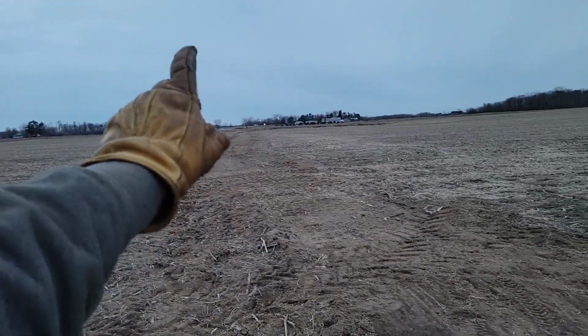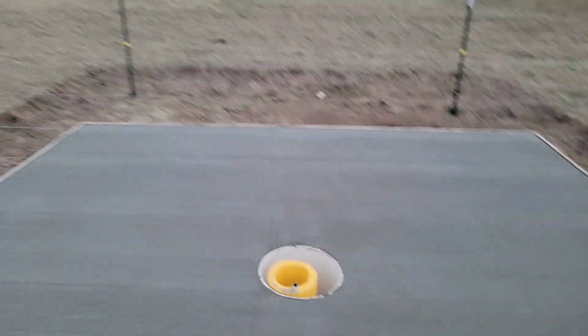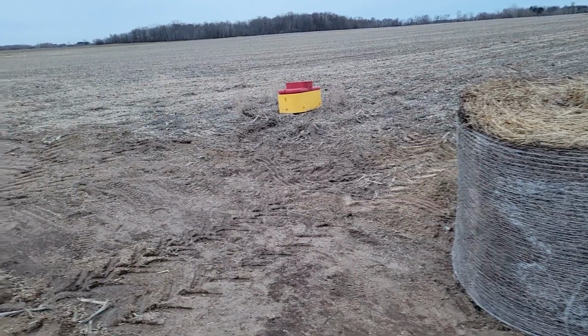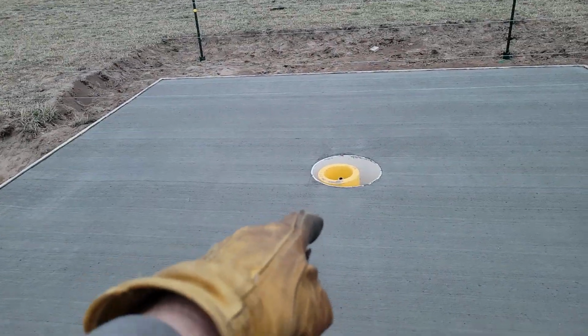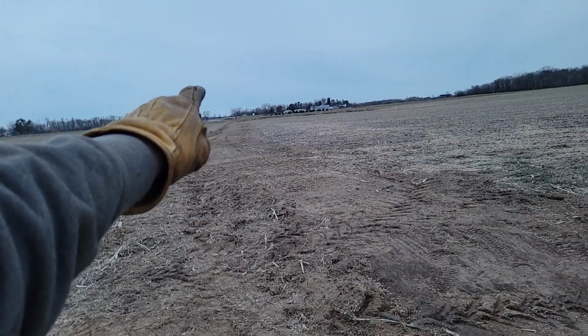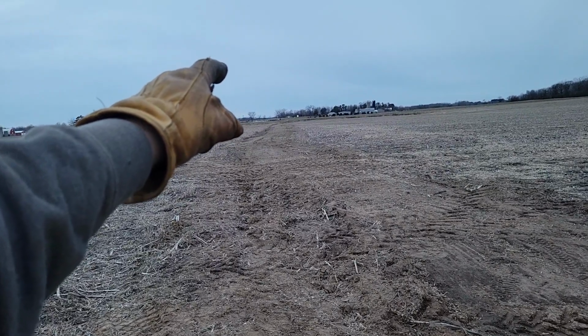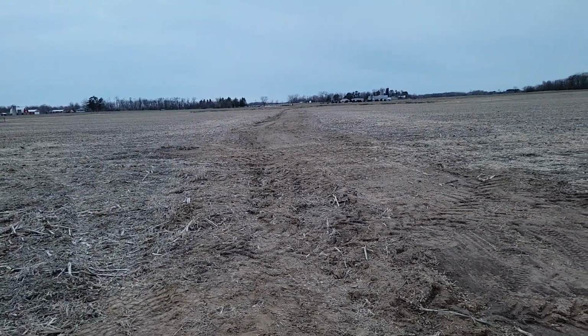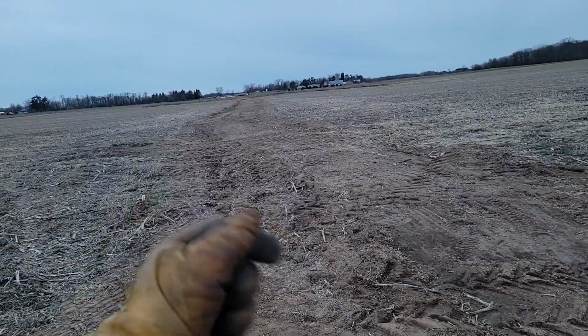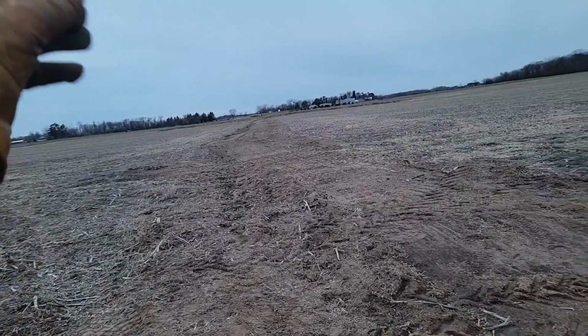Oh, I still got to get the well. The well is hooked. The water line is poking right up the top there. And so I get that in a couple days. Next week I'll drill in the anchor bolts for the water tub. So then I just got to build a doghouse around my pressure tank and get a meter from the power company and hook up on the pole and put a service box, a breaker box, after the meter, put a breaker box to run the well and a little heat lamp. And then by golly, we'll have water out here.